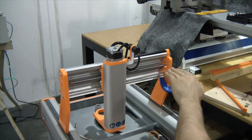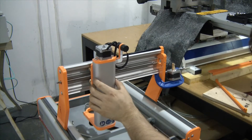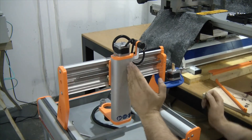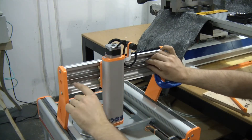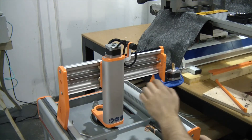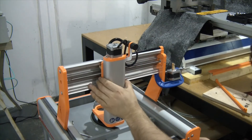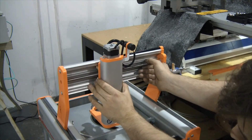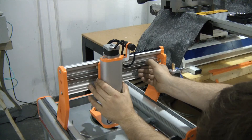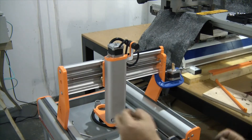That way I'm able to check the horizontal alignment of the ball screw as it goes into the end conditions. Because when it's fixed, as this moves towards the end, if it is high or low it will start to pinch and you get a stall in motion. As you can see, I've done very little disassembly and I can verify motion in the x-axis ball screw. Now I can reseat my end bearing.